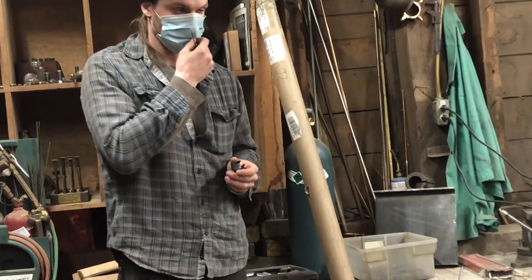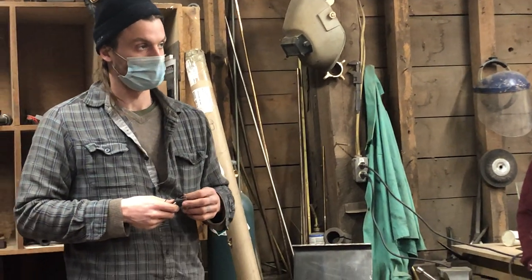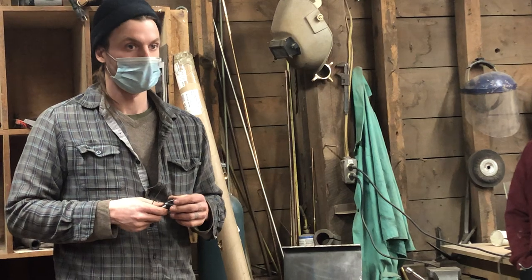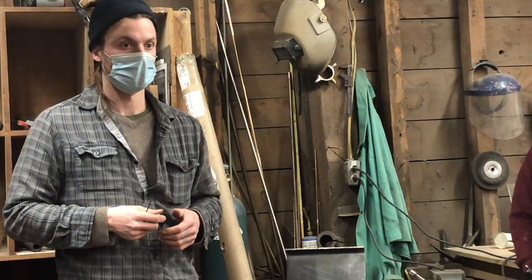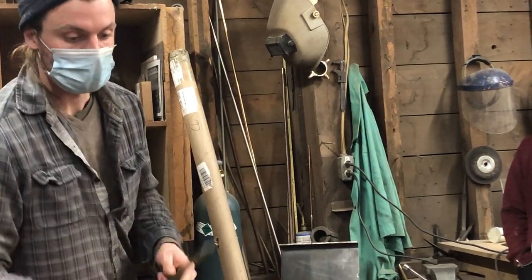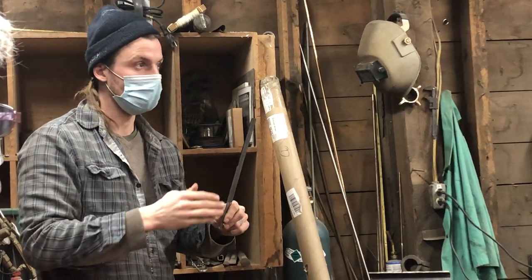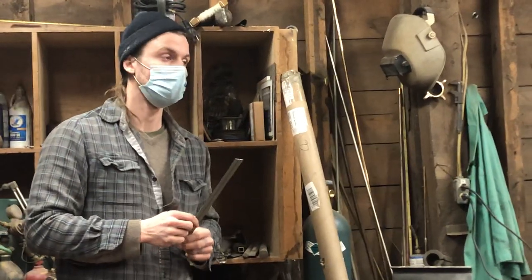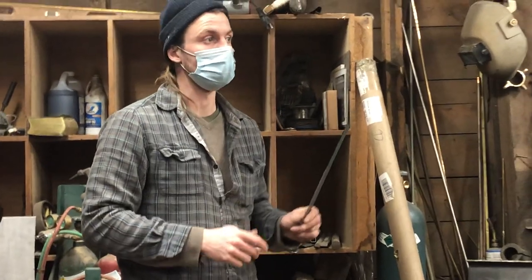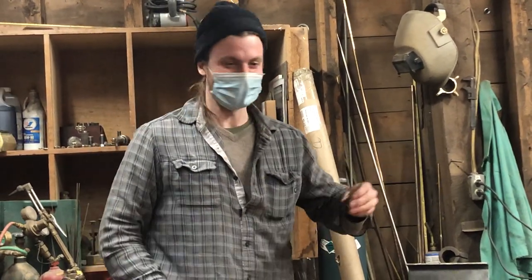How do you discern whether it's the bung cutter that's out or the table that's out of square? You mean when you lower it down with it not going? Yeah. You can just take a combination square and, without a drill bit in the drill, bring it down and stick it right up against the chuck and see if it's square or not. If it's square, it should be square to the chuck, because all that stuff is concentric on a chuck. And then if the table's out of square, you're never going to true up a bung cutter. You're like, I keep spinning it and it's crooked every time, goddammit.